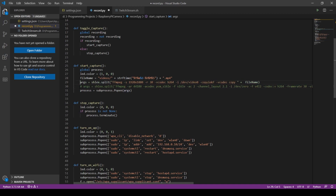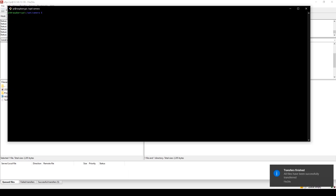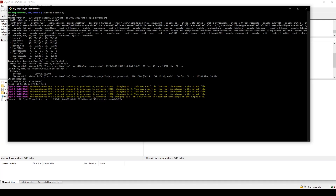Let's go over the progress I've made and where I plan to go next. What you see in the background right now is me simply trying to get Python code — which is what I'm controlling this all with — to run FFmpeg and use some basic GPIO pins to control it, so a start/stop button mainly.